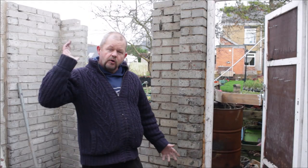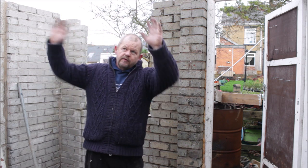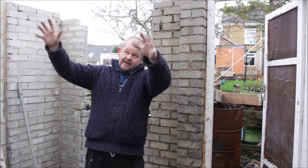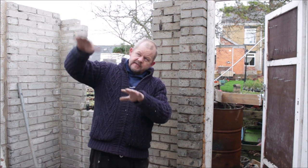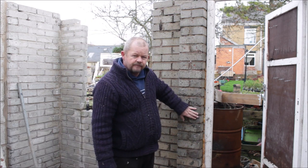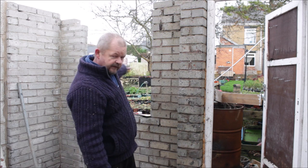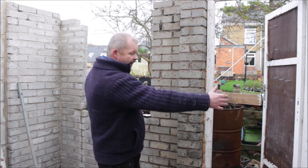Well you've just seen all the roofs down. I've waited for new roofing sheets to turn up, and I can put the joists back in and lower them down a little bit — that's why I took the joists out, they were sat too high up. Now I want to make this door wider, so I'm going to take this pillar down, build a new pillar up there, brick that window up, so I've got a wider door.